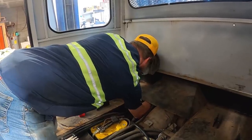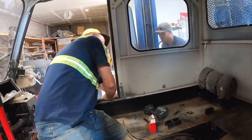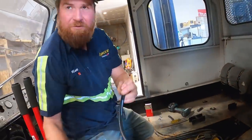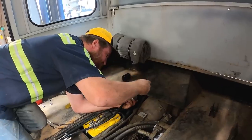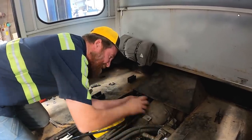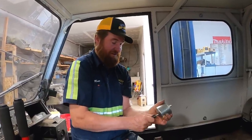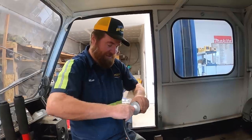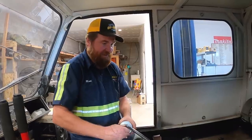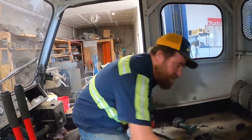You got two of the clamps? Yeah. Okay, here's your screwdriver. One goes one way, one goes the other way. Do your worst. I swore he had the fuel filter in backwards on the return line. So, on EFI, the return line is smaller than the fuel line. Right? Apparently. Well, but I knew that, but this isn't the right fuel pump anyway. So they had a 5/16 fuel pump on a 3/8 line, and they just tightened it down so that it would only leak a little bit.